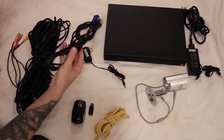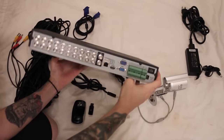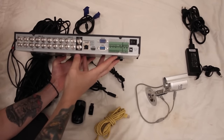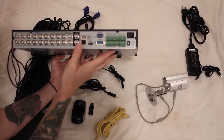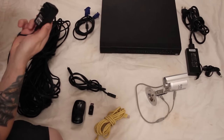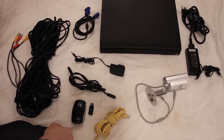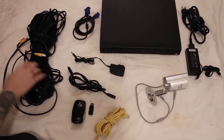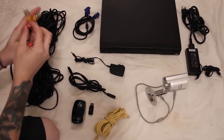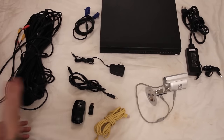You can choose between an HDMI cable or a VGA cable — these DVRs have different ports on the back including VGA, HDMI, and a composite video out for a BNC monitor or with a BNC-to-composite adapter. You'll also need a power supply for the camera — this one is 12 volt 0.5 amp. I also have a plug-and-play cable, which has two ends: each end has BNC for video, a male connector for power, and a female connector for power. That's pretty much everything you need to get started hooking it up to the internet.